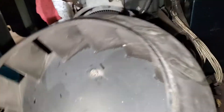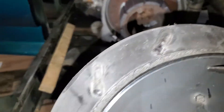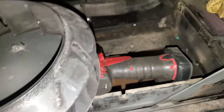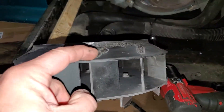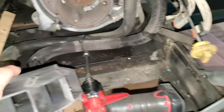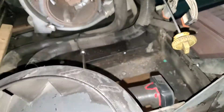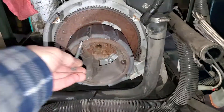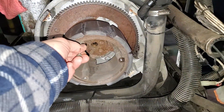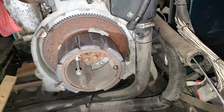This was on there like that — that's your fan blower system. You want to check each one of those plastic pieces. We check these plastic welds, make sure they're not cracked, because if that lets go it'll go out of balance. These three bolts tie into the rotor — this is where a magnet let go.